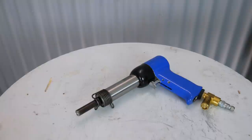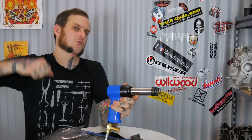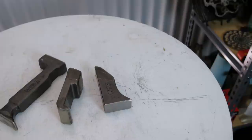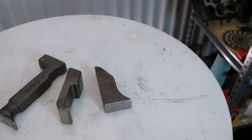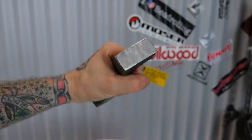There is a difference between a rivet gun and an air hammer. A rivet gun hits slower and softer than a regular air hammer. The reason for this is you do not want to drive that rivet into the panel — you could actually dimple the panel around the rivet head by hammering too hard. Next, you need a bucking bar. The nice thing about bucking bars is there are a bunch of different shapes available. This one's got a nice pointed tip you can use to get behind a crossmember or into tight areas with the different shapes and sizes on the market.